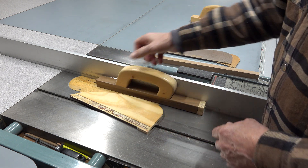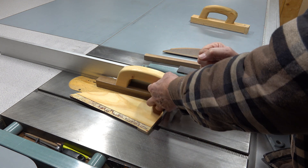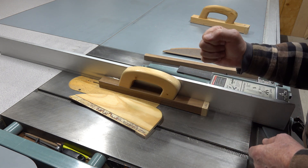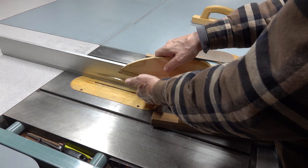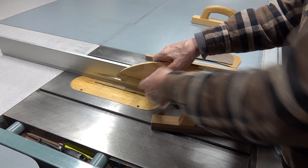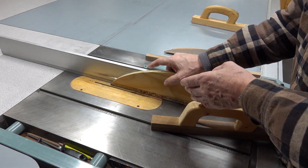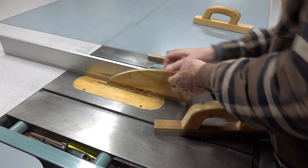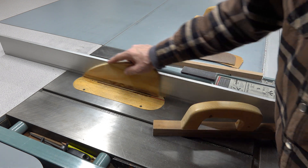I've seen some designs out there that I really like the way they look — they have handles on this end. But if you think about it, the front end is free to walk and you really don't have any control over it. The further away your handle is or the taller you make it, the more leverage the lumber has against you. So the closer you can be without being in danger, the safer you'll be. Mine is just above the fence by maybe an inch and a quarter, and I ride my other finger literally on top of the fence.